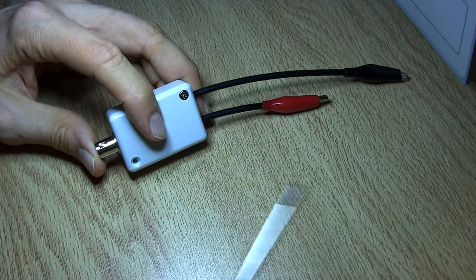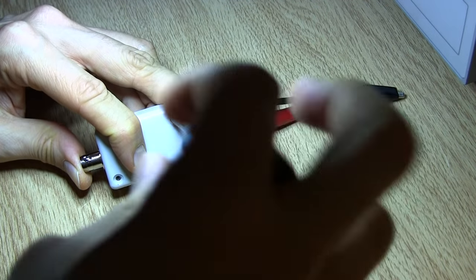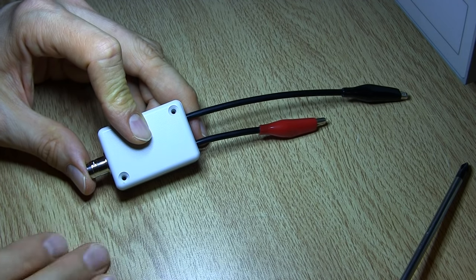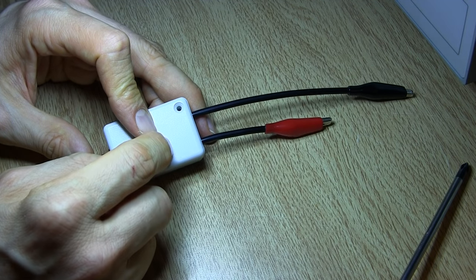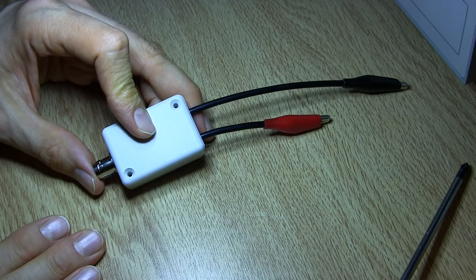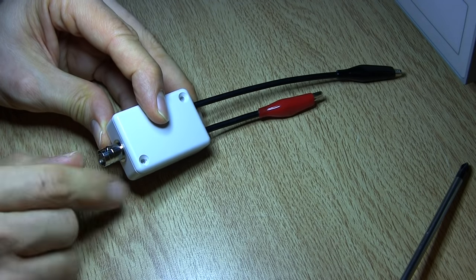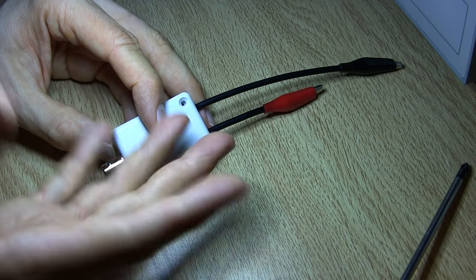Let's check out what's inside this little box. I've removed one of the screws already — they're self-tapping Phillips screws, so the first time you run them in they tap a little extrusion that holds the lid on. After that they thread in and out really easily. I chose a plastic box because this is dangling inside chassis a lot and there's a lot of high voltage circuitry that a metal box could short out on. By having a plastic box it saves you from doing any kind of damage.